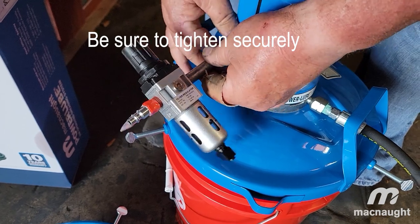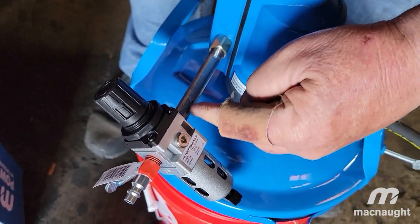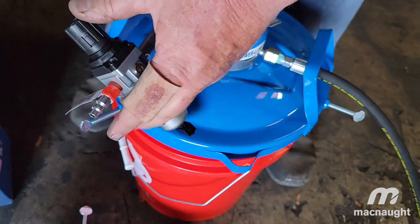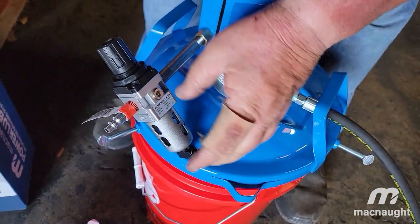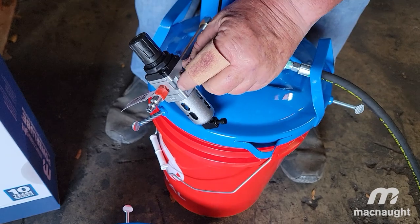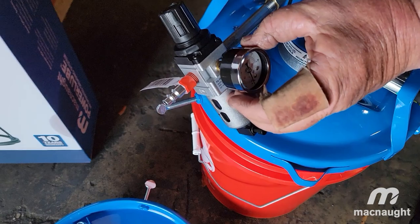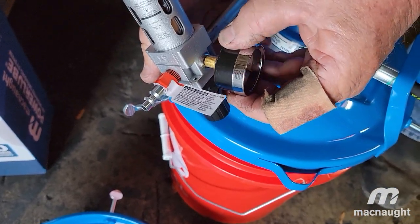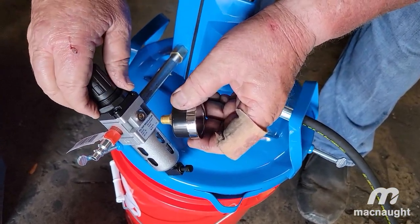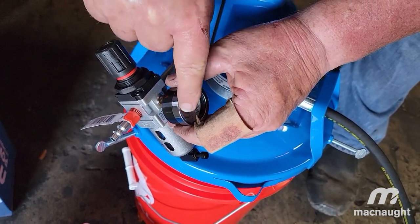This right here spins, so I used a long shank because this thing needs to be as low as possible — but you can't be way out here because it'll be in the way. Your air goes in, and with this right here you put your gauge here. Depending on how it's facing, you want to be able to see the gauge when you're working. Once the gauge goes on you put the air in, pick this up, turn it left and right, and you'll actually see your gauge come up to the pressure you want.